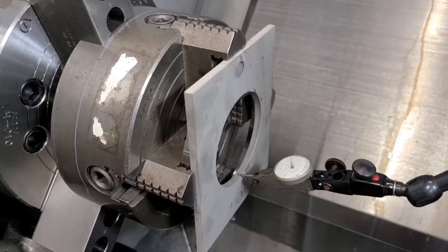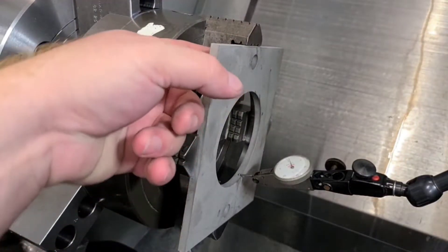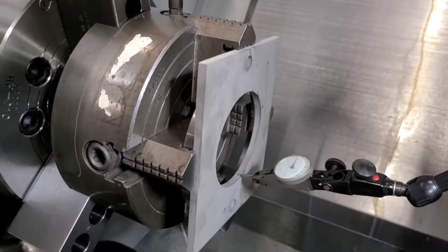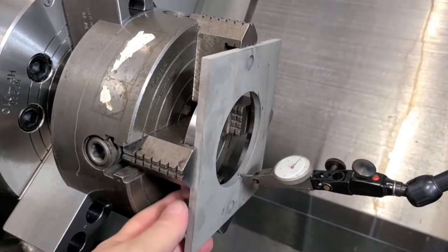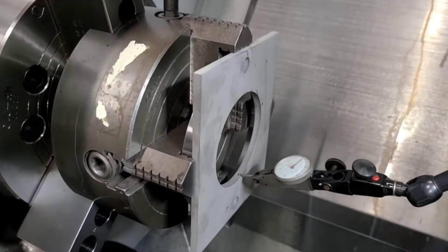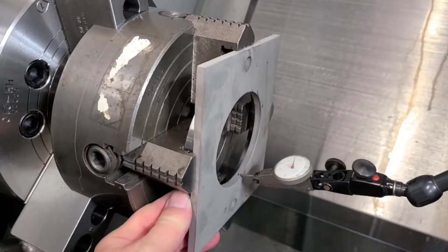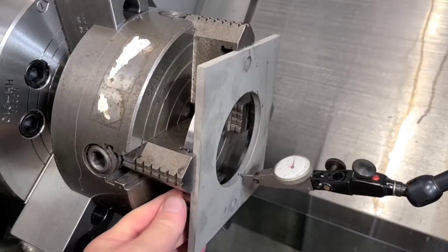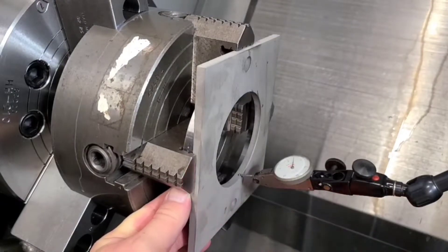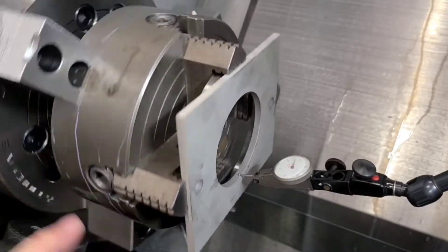Things are not always so easy — my ring is not exactly where I'd like it to be; I want it to move up a little. To do that I'm going to loosen one jaw, which throws everything out of whack. I move the ring up to where it's seated, tighten back down — chances are run-out won't be perfect anymore. I'm spotting the ring, making sure it contacts everywhere on the face it's supposed to, and tapping it back in. Checking the inside: we're back as good as we had initially.